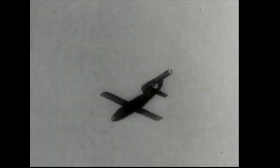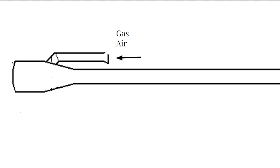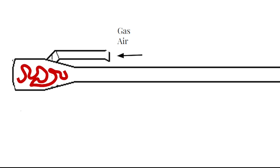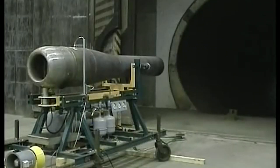It was replaced by the turbofan, which, as I mentioned before, has a lot more moving parts but is significantly more efficient. But for this project it's perfect because it has zero moving parts and is relatively simple in design. Air and gas are sent through the intake into the combustion chamber. The gases are then sent out the exhaust in a rapid explosion, and this happens a few hundred times each second, making the distinctive pulsejet sound.